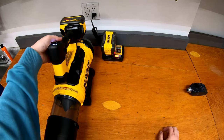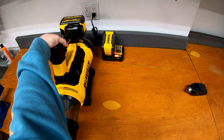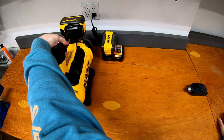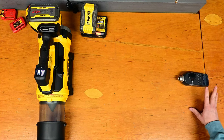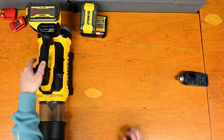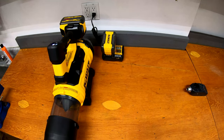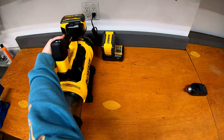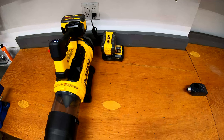Let's see how loud it actually is. I have a decibel meter — just my old Radio Shack one. On eco mode it reads about 90 decibels at roughly ear distance from the blower. On the medium setting that was about 93 decibels. And on the high setting that was about 95 decibels, measured on fast response C-weighted.